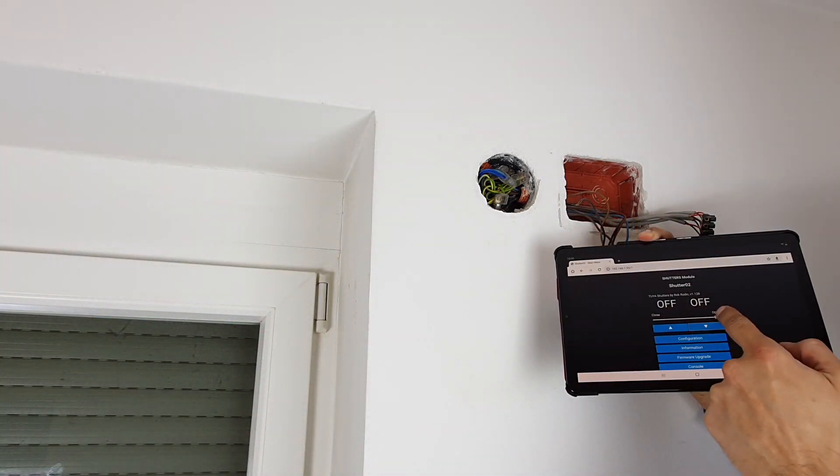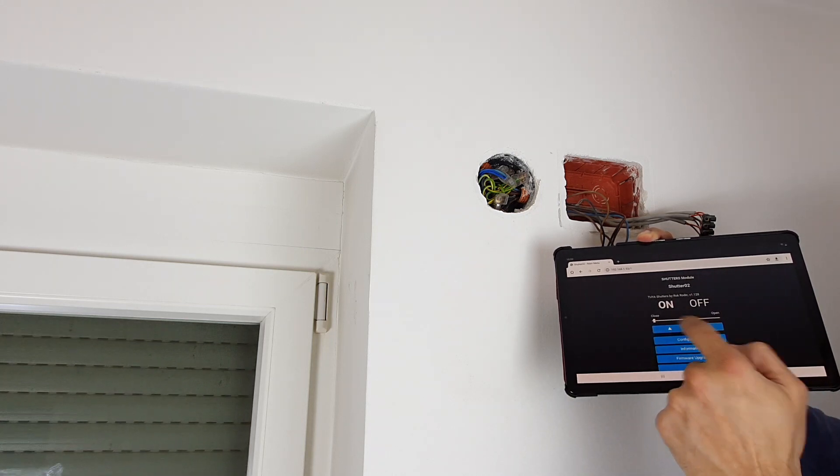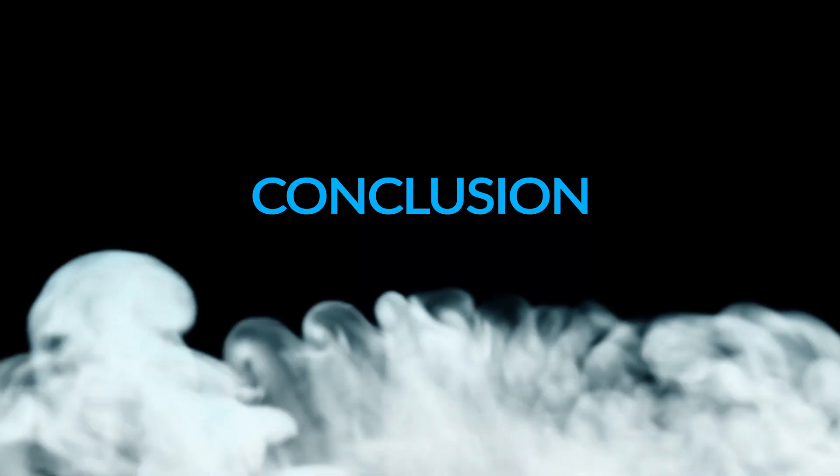Let's check the tablet again — up is up, down is down. So this was a simple and fast Tasmota code modification to use on Tuya modules dedicated to shutters. I have shortened the modifications as new versions of Tasmota come out every few days. The ideal way would be a separate code module using even more simplified code. The solution running inside the main loop counting zero crossings would interfere with Tasmota's execution times. Do comment below and present your solutions. See you next time!